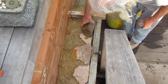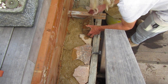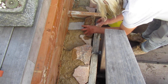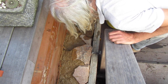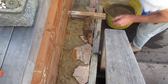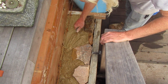This is a good example of how I finish off this corner of the wall. I found a nice square block I want to fit in place and I'm backfilling it with some concrete. It's not quite stable, so I grab a piece of scrap concrete and place it behind it to prop it up vertically. Then I add a packer in the front of it to keep the profile consistent with the other stones. We then add some concrete on top of that scrap piece to back up this stone. To finish this section we find a small stone to fit between the large stone I just laid and the one next to it, continuing to fill them out level with concrete so they're ready for the next course. I add a few more pieces of scrap concrete to help fill out this area and bring the concrete up to the top of these stones.